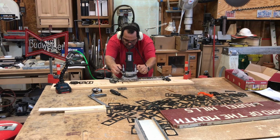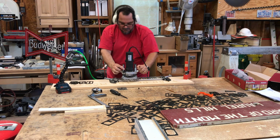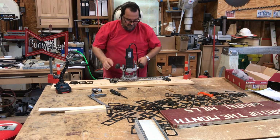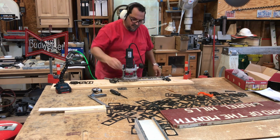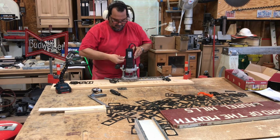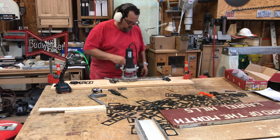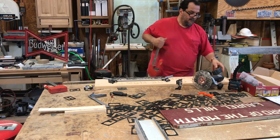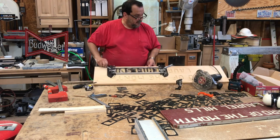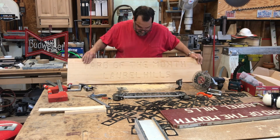Now watch this. This is actually a brush cap that fell off, and of course the unit lost power. You can see it right there in the foreground there by the letter F. Unplug the unit, screwed it back in, grab the screwdrivers, tighten it up, check to make sure the other side was tight, and get back to routing. That's not something that happens every day. Alright, all routed.